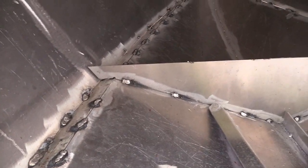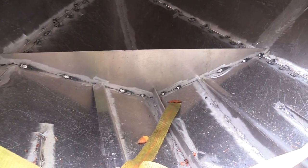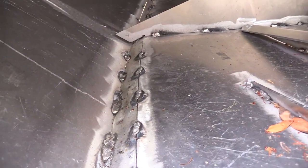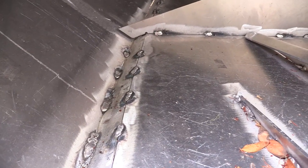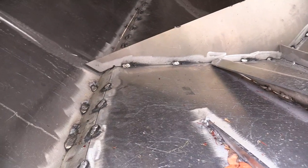where I cut the bulkhead and I set it in the bottom there, this is an attempt to try and fix it or correct for it somehow. I thought I could use that bulkhead cutout as a guide to straighten out the front of the bottom of the hull. When I did that, that edge right there was even with the side of the boat, and that chine was at the bottom of that CNC cutout there on the bulkhead.